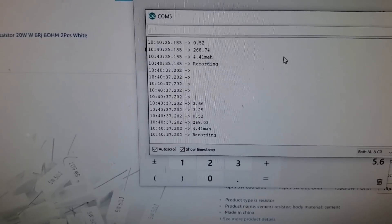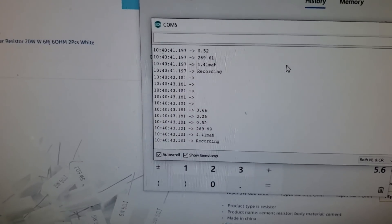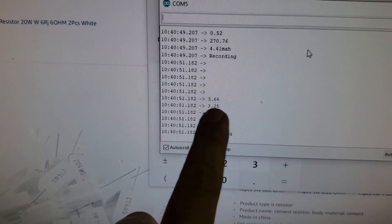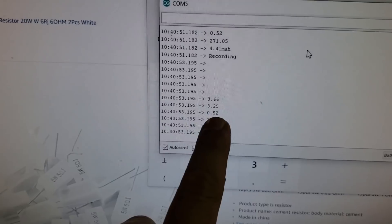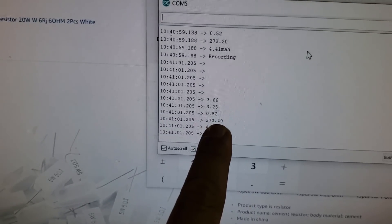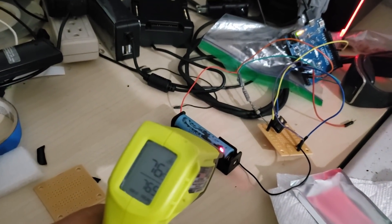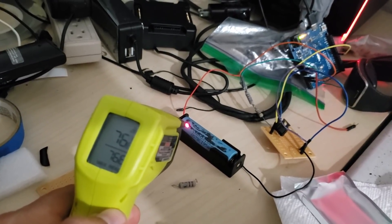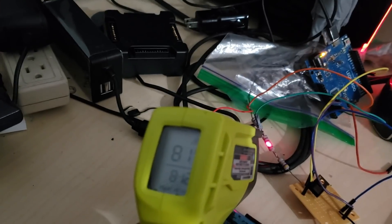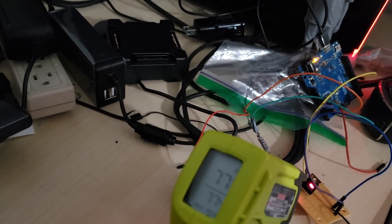About 15 minutes have passed since I checked the voltage and temperature, and a total of roughly 35 minutes since I started testing. As you can see, voltage has gone down from 3.7 to 3.6. The constant current remains at 0.52A. Regarding temperature, the cell is still pretty cold — the highest I saw was 79°F. The resistors got a little bit warmer, around 80°F, and the MOSFET is still pretty cold.